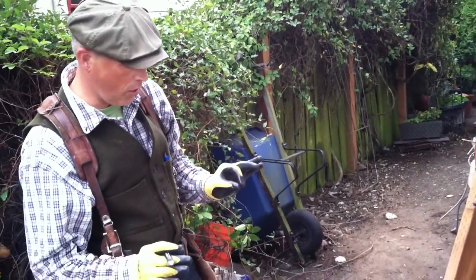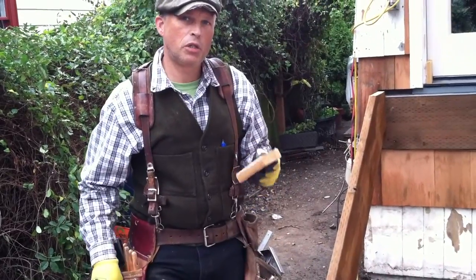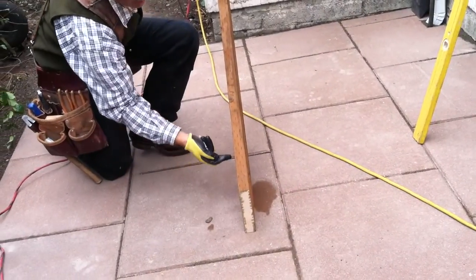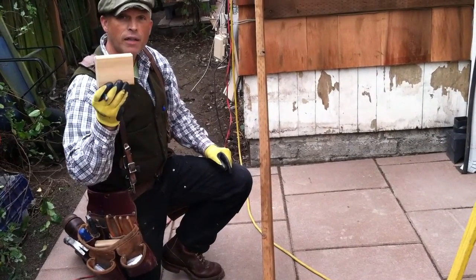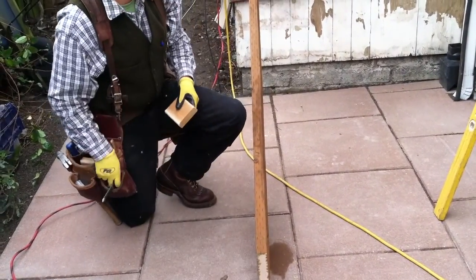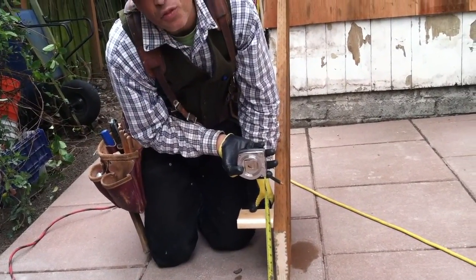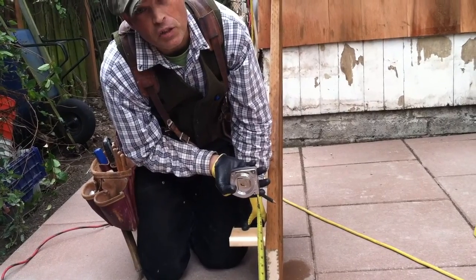Now there's something that you have to remember, is that you're adding decking to each tread. In this case, you can't see it with the camera, but our first cut on our tread is here. This distance is the same as this distance all the way up. If you add 1 inch decking to this tread, your decking's going to sit here on top of that tread. That puts your tread at 7 13/16 plus, but it really should be 6 13/16 from finish to finish.